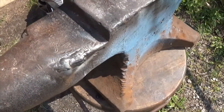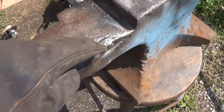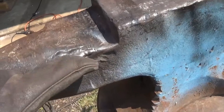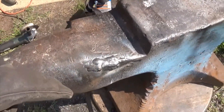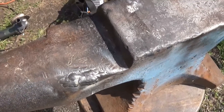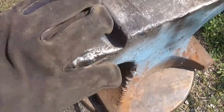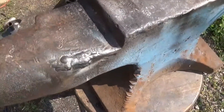There's the second pass — I've got some metal back in here, starting to build this lip up. I'll go ahead and do some more welding down in here, get that on. I want to get this as close and as flat as I can, like this other side. When I'm done I'll weld probably just these corners with the hard facing rod.